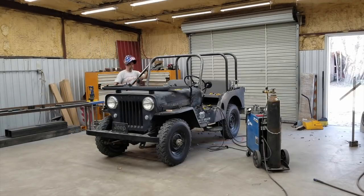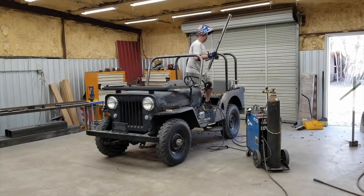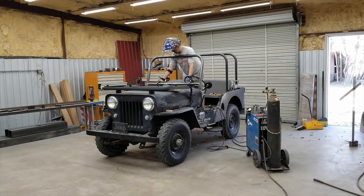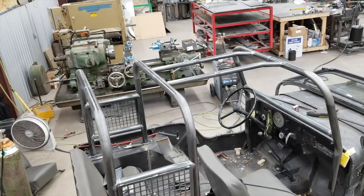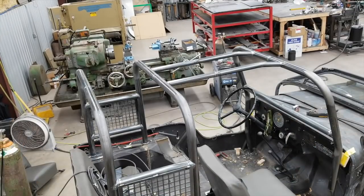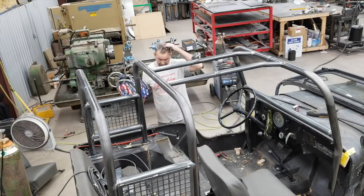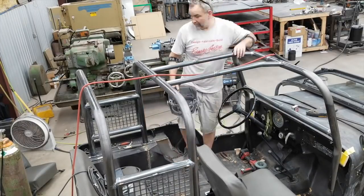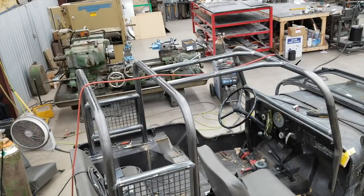The gap was a little bigger than I wanted — it shouldn't slide in that loosely. I had gaps on each end of maybe an eighth of an inch or so. I double-pass welded it — went around, welded up the gap, then wire brushed and ground some areas and put another pass on it. A couple of areas I went around with the MIG first, ground that down, wire brushed it, then came back with the TIG to put a nice finish weld once the first weld was complete.